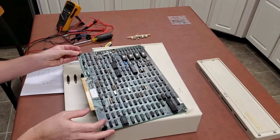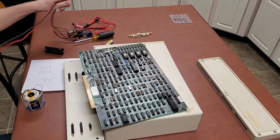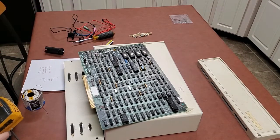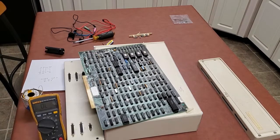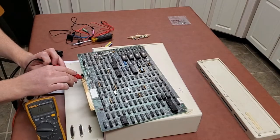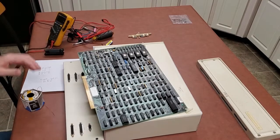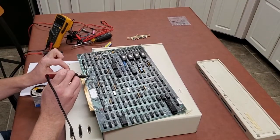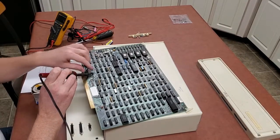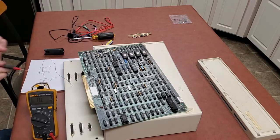After that I'll power it up and see what I get. I'm going to lift this capacitor and make sure that is where the short is. If I go from five volts to ground, it's about 43 ohms. So let's lift this capacitor and see if that clears. No, it didn't — so that's not what the problem is.